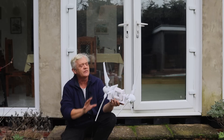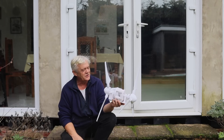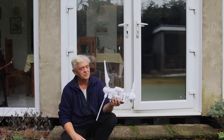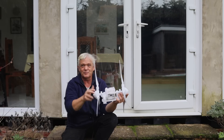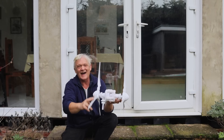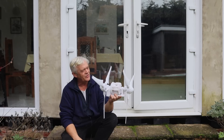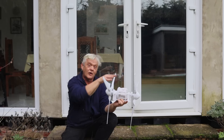For the last three days we haven't had a breath of wind, and we haven't got any today — it's a shame, I'd have liked to test it in real-world conditions. However, we haven't used any new concepts: differentials are known to behave this way, the dual rotor is known to be an improvement. If we hold one rotor still and turn the other, we still get power on the output shaft — and the same if we reverse it, or turn both together. So it should work; we'll test it and see.